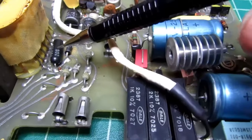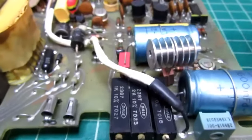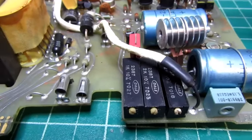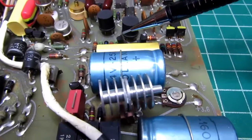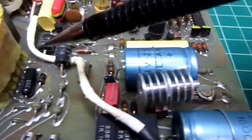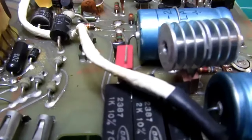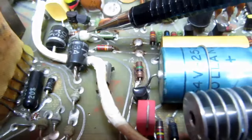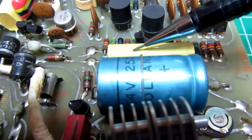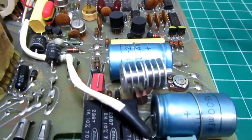There are various diodes scattered around for different parts of the power supply, and those develop a high voltage supply for the Nixie tubes. There's a 3.6 volt regulated supply for the logic ICs — these are all RTL types, running at 3.5 or 3.6 volts. There's also a plus and minus 12 volt supply, done by splitting a higher voltage supply in half with Zeners and grounding the middle. So there are only three electrolytics on this entire meter: one for the 3.6 volt supply, one for the analog power supply, and a third used in the same 3.6 volt supply circuit as the post-regulator stabilization capacitor.